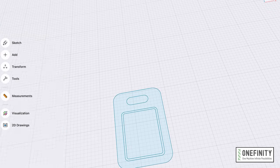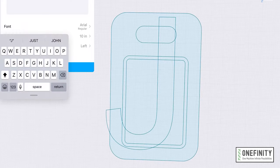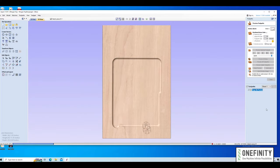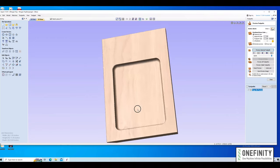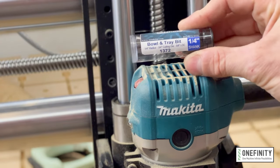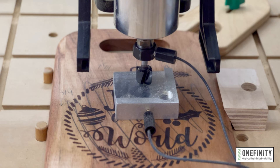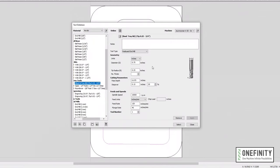On my iPad, with the help of Shaper 3D, I drew up a simple rectangle and a brand new personalized message. In VCarve, I created a pocket toolpath to cut out a shallow dish-style cavity using a bowl bit. That'll get rid of the laser-etched design and give the whole thing a little depth and functionality. I used the bowl and tray bit from Bits and Bits — it has a quarter-inch radius, a three-quarters-of-an-inch diameter, and a five-eighths length of cut. Because this bit is three-quarters of an inch around, I took fairly light passes and set my feed rate down to 100 inches per minute.